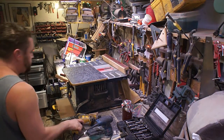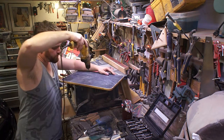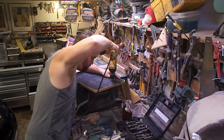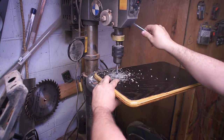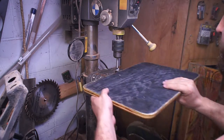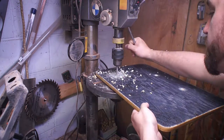For the second one I thought it might be a little easier to drill a pilot hole through and then sneak up with the forstner bit. That little brad point — you just have to get it just right or you'll go all the way through. I broke a tiny drill bit off, but just doing a pilot hole so I could drill halfway through on the top, then flip it over and drill halfway through the other way — that made it a little bit quicker. On the second side I can find the other part of that pilot hole and just go straight down into it.